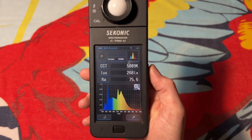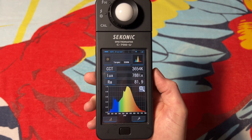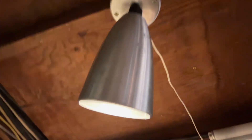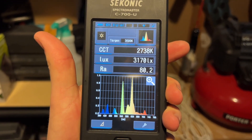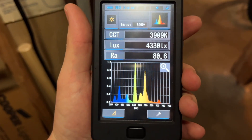Let's get a combination of the two with the drafting table lamp. Nice — this thing is going to be a lot of fun. In this little floodlight here I have a 9-watt warm white PL flood adapter. Let's get a reading from that. That's our reading with the PL bulb — pretty spiky, as you can see. Definitely 2700K, just like it says. Now I have another one of these over here with a PL adapter — this one's a cool white. Let's get a reading on that — and that is about 4000K or so.